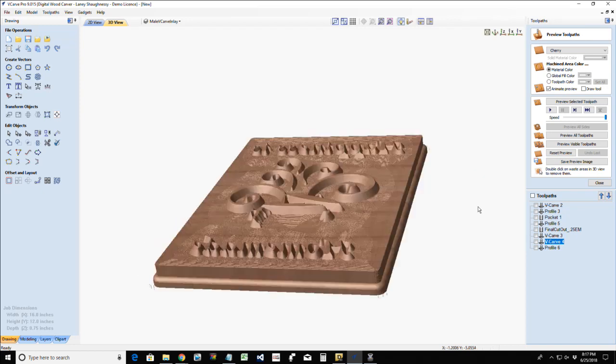I just surface plane a cutting board. I wouldn't run it through a planer on an end grain cutting board. But your face grain, all day long, you can run it through a planer. Absolutely. Yep.